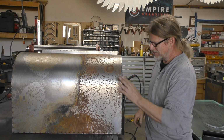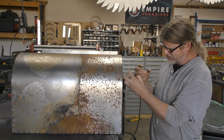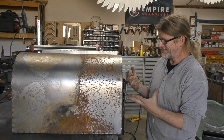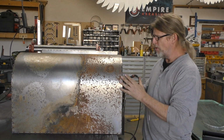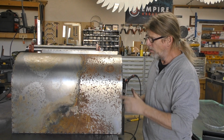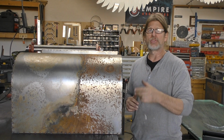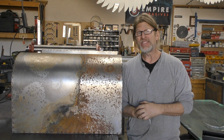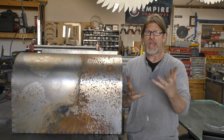Okay, so basically I've knocked down all the edges of the sheet metal that were not quite flush with the framework, and now you have a decision to make. Either you go with just the tack welds as kind of an elemental design, or you can come back in and fill in those welds and then go back and grind it all to a nice round corner. But for the most part, that's how you put sheet metal onto a frame or a shape that you want to create.